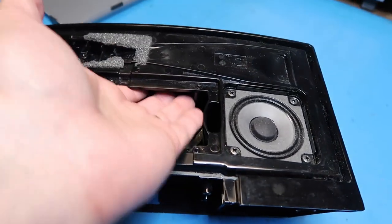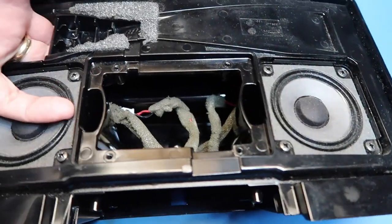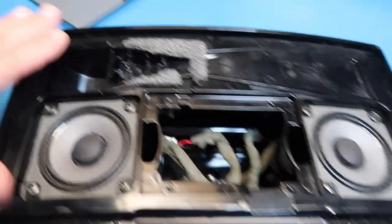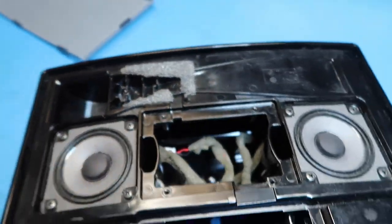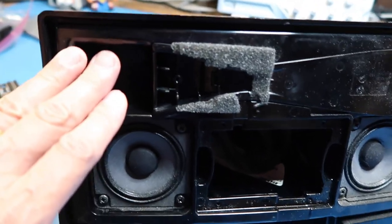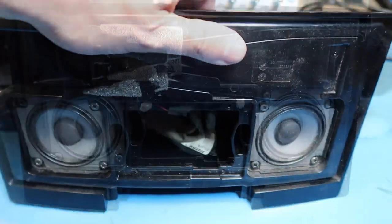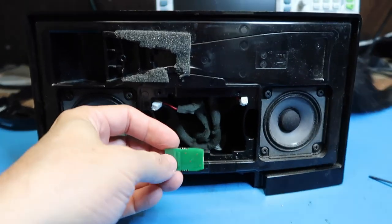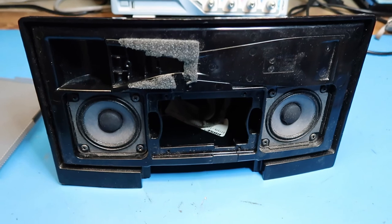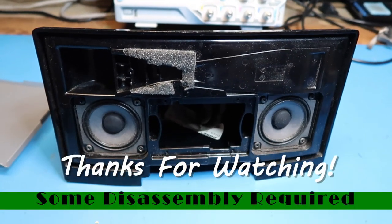I went online and found a service manual — this is one of those things that's obvious once you know the answer. This is an infrared module sensor used for the remote control, which is good news for me — I don't need to worry about any replacement. Basically I can hook up some connectors on the bottom, maybe by drilling through, put this plate back on as a cover, and have a viable two-channel or wired-together single-channel speaker for a center speaker application. There's more insight acoustically — there's a slot that works its way back through, which is the porting hole for the two speakers. The reuse part we'll make into a separate video, and I'm planning a comparison of center speakers I've acquired. Thanks for watching and bye-bye.